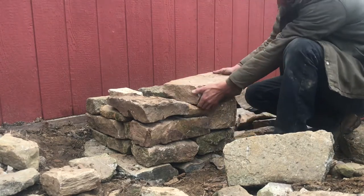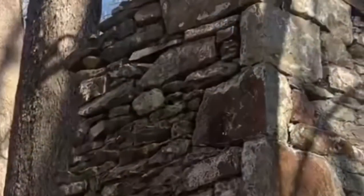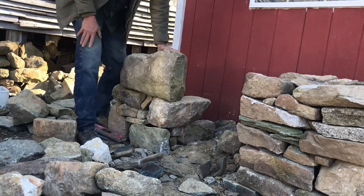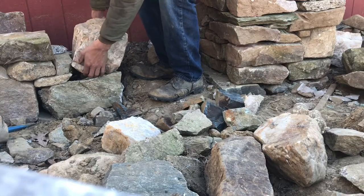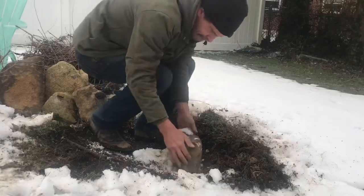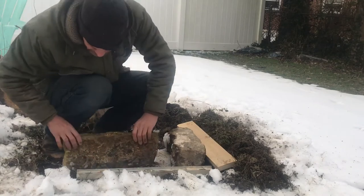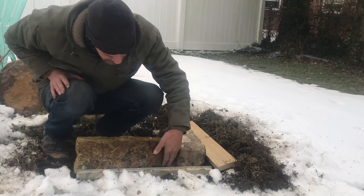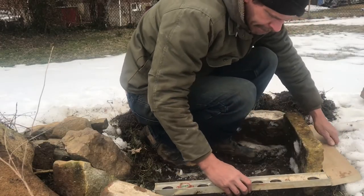When you're out in the real world you see stone corners like this all the time. They look great, but there are practical reasons for building a column this way. A stone corner can be built very quickly if you stand stones up on their edge. But if you don't follow a few rules this could end in disaster — you must make sure everything is tied together inside and out. I start by establishing my corners, check the square, and fill in the gaps between the corners to give me my first course. If you don't have a two-foot square you can use a level and a straight board as a rudimentary square.